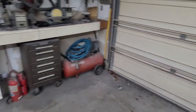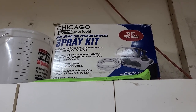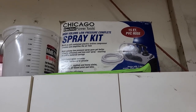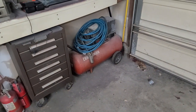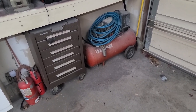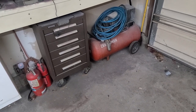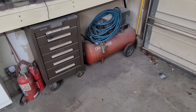Next year I'm going to be doing something a lot different as far as painting goes, probably starting this summer. I picked up a spray setup from my father — I think it was a year or two ago as a Christmas present. Since he's retired, he had it at work painting machines, and now it's home and I'm going to start using it. It beats the hell out of using this compressor, which makes a whole lot of racket and doesn't keep up with the air being used. Plus you have to empty out the tank for water every year, otherwise the water collector on the line fills up pretty quick.